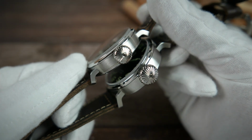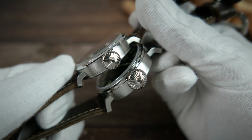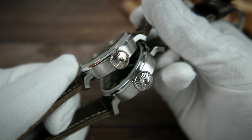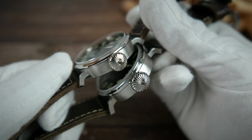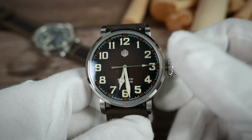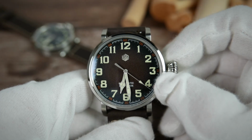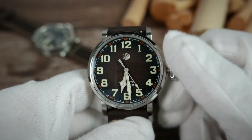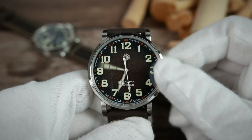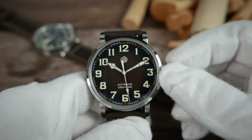Both crowns are huge relative to the watches. They are onion-shaped and gnarled, providing perfect grip. That was a key feature in the aviation watches of old, as pilots often had to use them while wearing thick gloves. Screw them out and twist up to hand wind the movements. Pull them out one click and you'll find the ghost date position, where you twist them and nothing happens. Pull them all the way out. The second hand stops on both watches, and you can set the time.